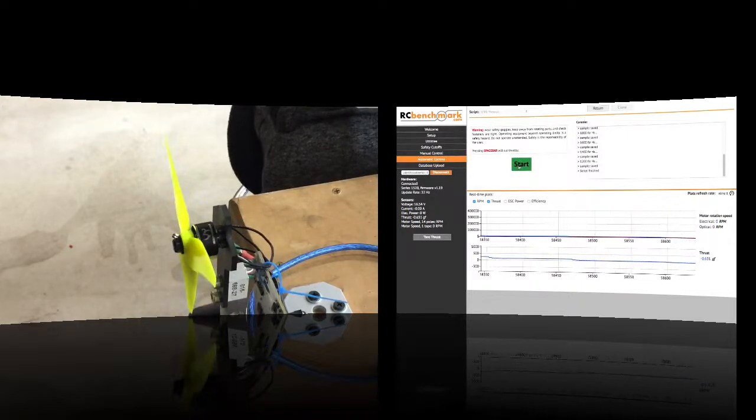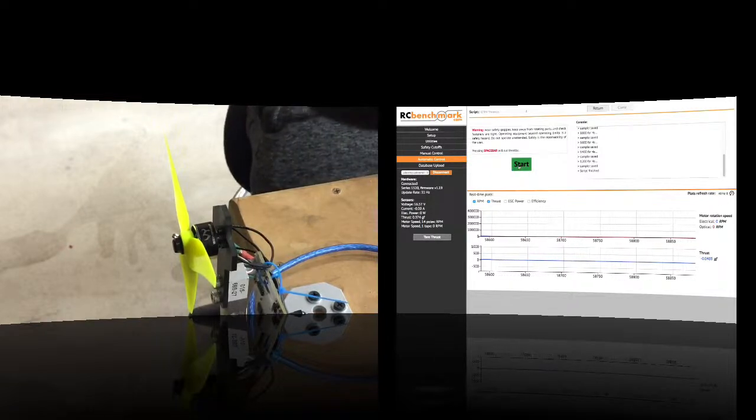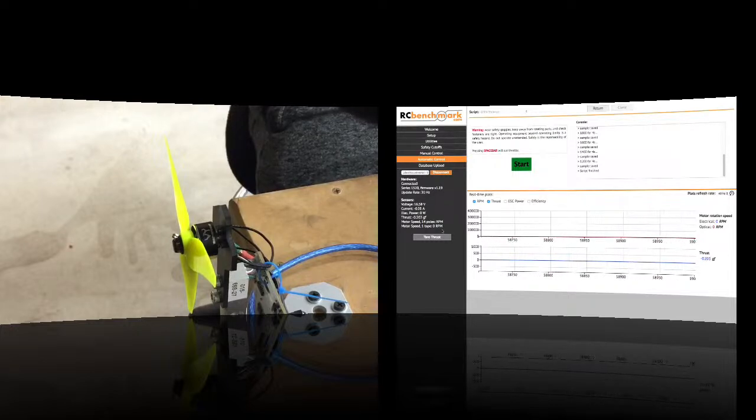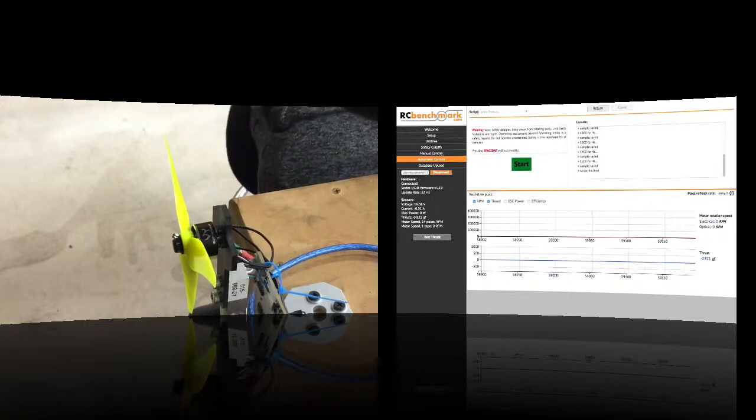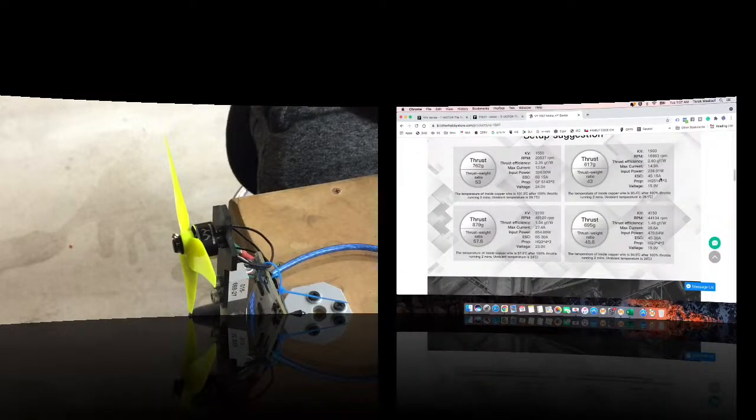So I will say that the KV jump, 5.1 by 4.6 by 3, right? And we had like 540 grams, let's say. All right, so let's look at it real quickly. If we had 540 grams and it stayed under 15 amps, I have a 45 amp ESC running, so I really don't think it mattered. I guess what I'm looking at here is on their data, 4S at 15 amps, the ESC could be anything actually at this point, as long as it's over the 15 amps.